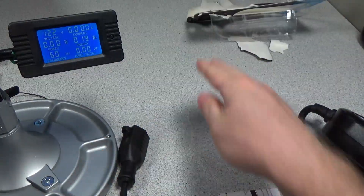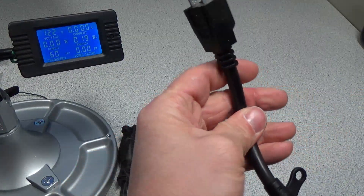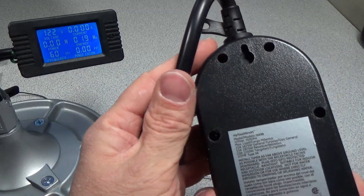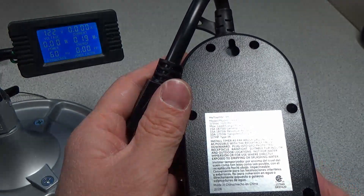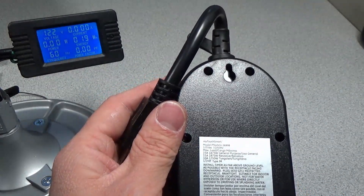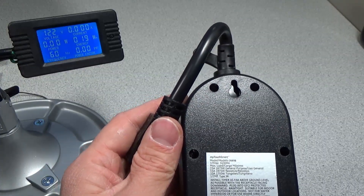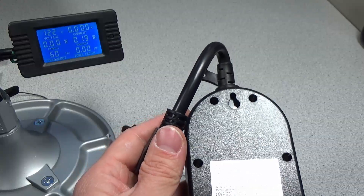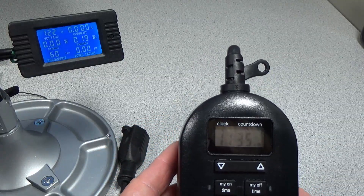See how wrapper-rage the packaging is — and gone forever. All right, so here it is. It's got a pretty heavy-duty power cable on there, that's good. No specific safety markings except for SA — I'm not sure what company that is. Made in China, 15 amps, 1,850 watts. It says 10 amps for tungsten for some reason. That doesn't make any sense — tungsten would be a power factor of one, so it should be able to handle that no problem.